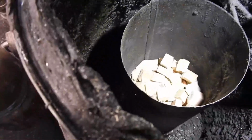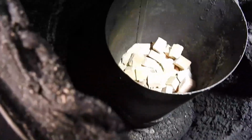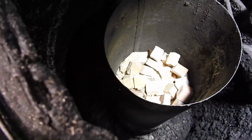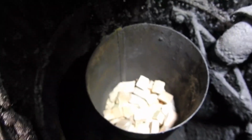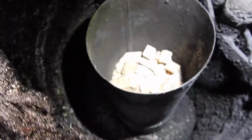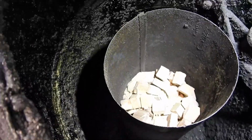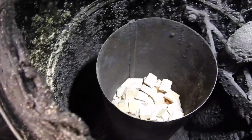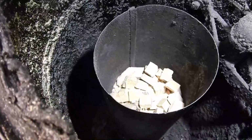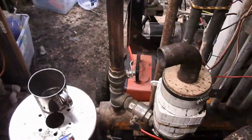The idea of this whole thing is that the metal work that you saw on the right side before I installed this couples heat from the burn zone. Instead of letting it leak out into the area all around, you see it's no burn, no smoke or anything, it heats up this metalwork, which in turn transfers some of that heat to the fuel and perhaps torrefies it a little bit in order to make it drier and better for use with the gas supply.